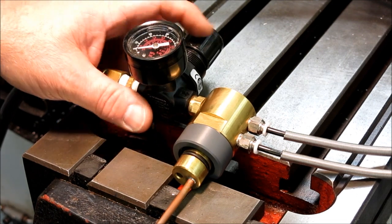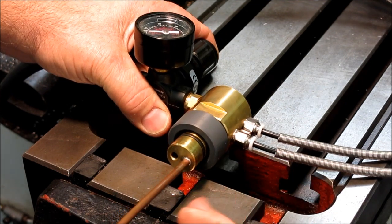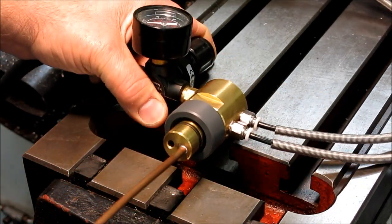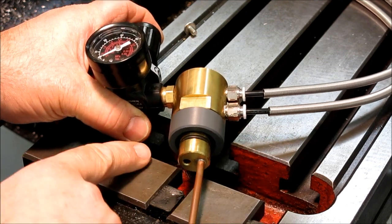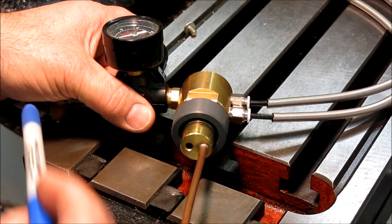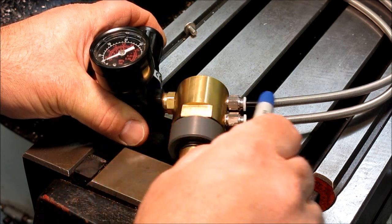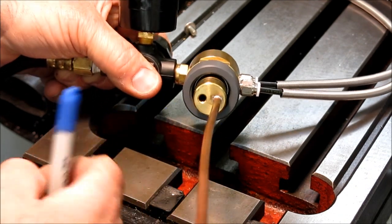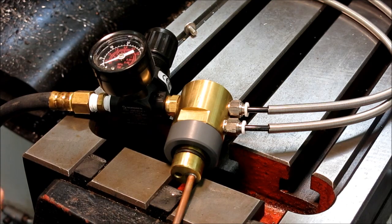Okay, here's the heart of this thing. This nut doesn't come off — it's trapped with a special wire snap ring that I made that fits in a groove up there, so it can spin but can't come off unless I reach in and pull that snap ring off. This is the gland seal that the bottle goes on to. It's ported — air in, down, out of this hole to pressurize the bottle. Then coolant comes up the tube and out this lower one here, and then this is straight-through air. So all the pressures are balanced through the system. These are just standard O-rings. The hardest part was making that particular ring.